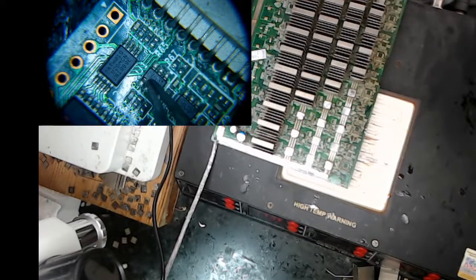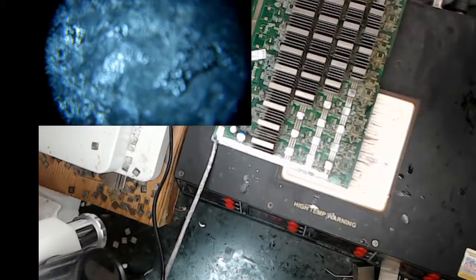But it turns out this guy was kind of blinking on and off on me, and so I replaced him. I happen to have some. I've kind of slowly invested in chips. I had some, and I replaced it, and two of my hard to fix boards were that problem. They were so transient, it was really hard to do. All right, given that, guess what? Our board's hot. Let's put the chip on.